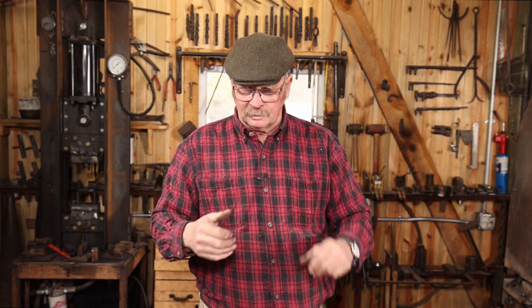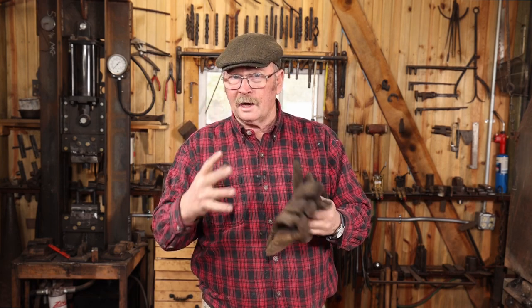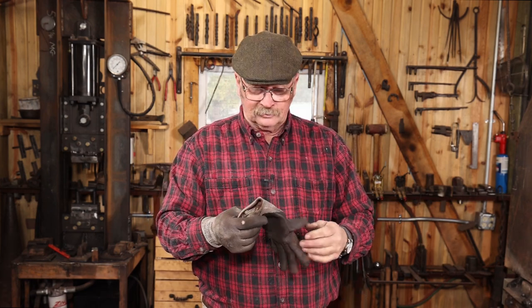So to me, wearing a glove around any kind of rotating machinery is a terrible idea. Now a little angle grinder where you've got both hands on it and you can't get your hand close to the rotating head — that's not such a big deal. And since they throw a lot of sparks, I usually will wear leather gloves while working with that. Now the big belt grinders — I frequently wear gloves with a belt grinder, and there is a risk there. I have known people that have gotten gloves like these baggy hot mill gloves grabbed by a coarse belt in the belt grinder, and some of them say their fingers were a little bit longer for a few weeks after that because of the pull it had before something pulled free. Not quite as dangerous as a milling machine, but I still wouldn't wear these around a belt grinder. That's what I keep these little abrasion-resistant gloves around for — I feel pretty safe wearing these.